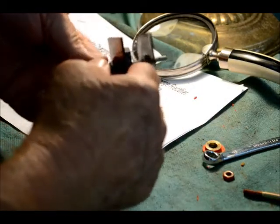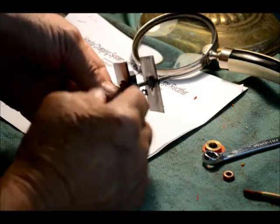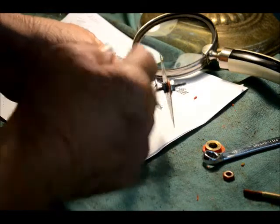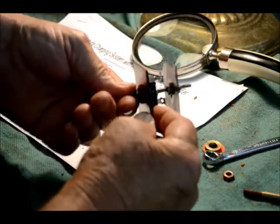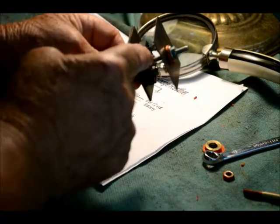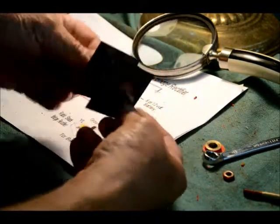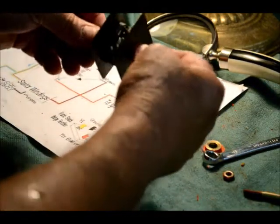With our terminals facing outward now, I can run my positive 12-volt wire to the battery. There's one AC wire to go to the brown lead, the other AC wire to the yellow lead, and then the final lead to ground. I'll ground it two places — to the chassis and I'll run a wire direct to the stator — to make sure I get a good ground.